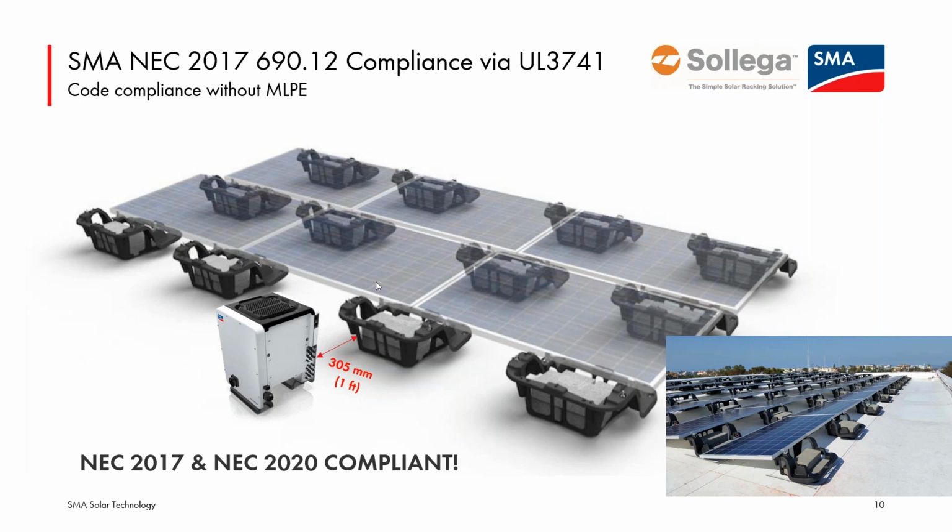So I don't know that it sounds like the Canadian code's a little more rational about rapid shutdown for commercial systems than in the States. But if you hear this term 3741 and why it's important, why SMA will talk about it a lot, is because it allows that type of compliance with rapid shutdown without needing the module level devices down in the States. So that's, I think, an important one.